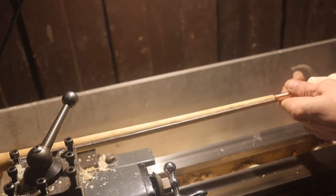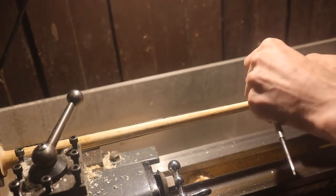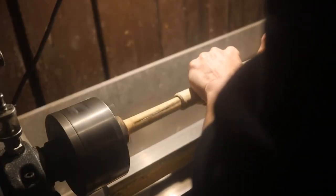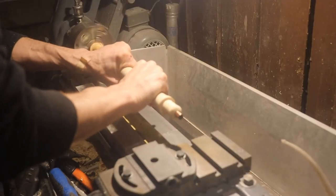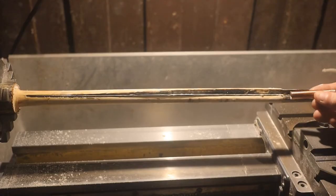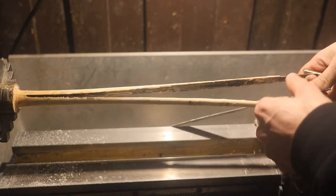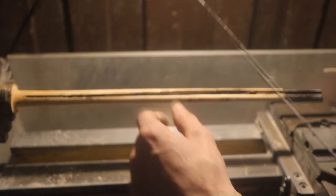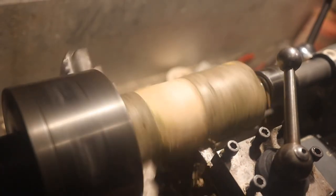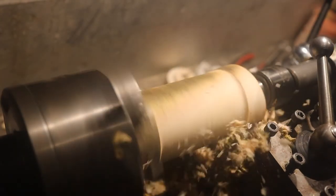Now it's time to actually try out the reamer, and it jams up immediately. But after that, it sort of worked. Like, I felt like I was making progress, so much so that I was ignoring that it was getting hot, and eventually it got so hot that the pitch melted. So when I pulled the tube back, the copper tube came out with it as well, and promptly slammed into my wrist. But I'm fine, nothing to worry about. I was wearing safety glasses.